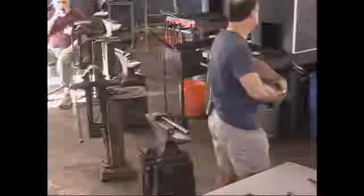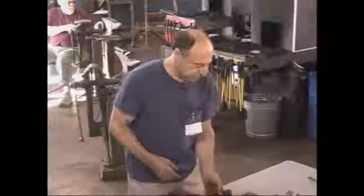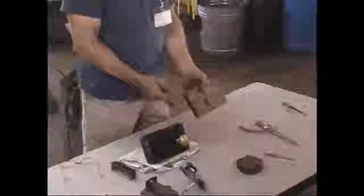And is that exposed, the black on the door? Yeah, this would be a surface mounted lock. Let's say this is the door. This gets mounted right on the surface. So almost all hardware from this period is surface mounted. Only the very fanciest locks from this period are mortised into the door itself. So here's a cheaper version of this same lock. What did they use to mount it to the surface with? Screws or nails, sometimes bolts. So either wood screws, nails, or bolts.